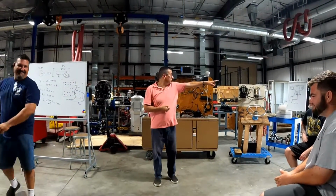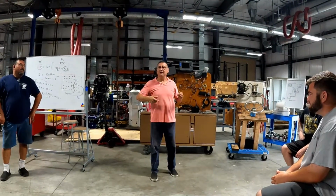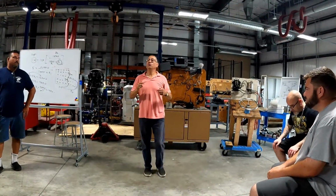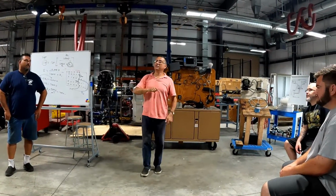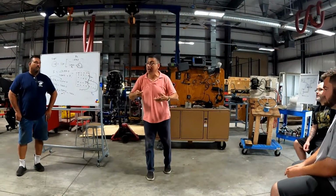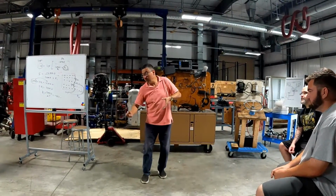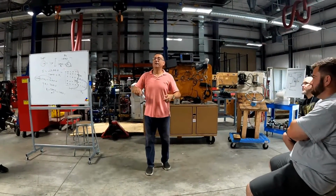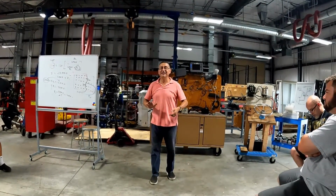But you can switch, yes, you can, but it's hard. What happened immediately when you start the engine? Power steering. Oh, wow, it's too easy, because you introduce extra power in the fluid. Extra power. Oh, nice. It's because as soon as the engine starts, you have a hydraulic pump that is connected with the valve and the crankshaft, and that pump introduces fluid at high pressure in the steering system. And right now, oh, nice, it's too soft. It's clear, my friends? Yeah.